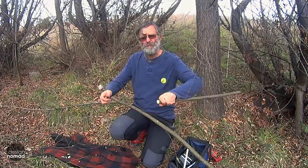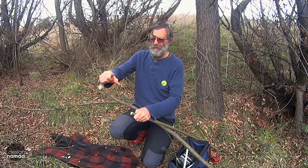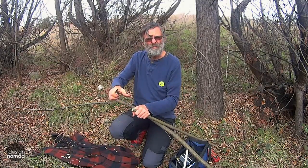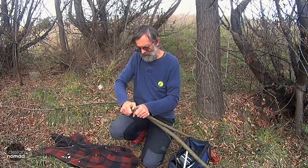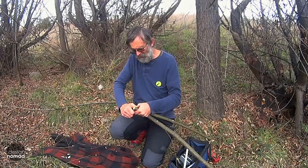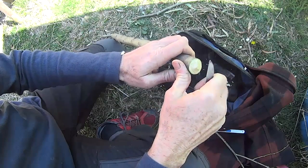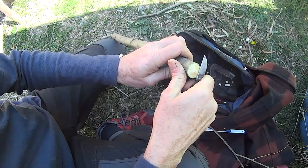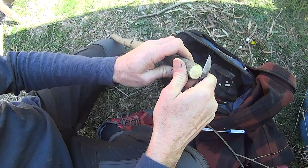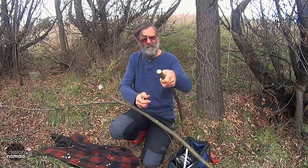Okay, here's another cut. This is a towards you cut. So you're actually going to do the movement is in the squeeze of your hand. So you can't cut any further, swing any longer than the length of the squeeze of your hand. So that's back towards you. It's not a dangerous cut. It's just paring away, just like you would with a good sharp chisel. Paring away that top surface, that end grain, until we've got a reasonably flat end on there.